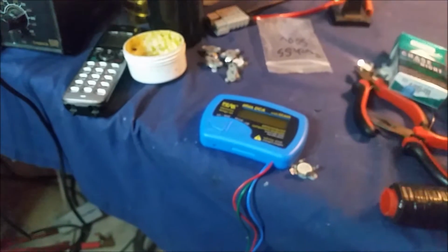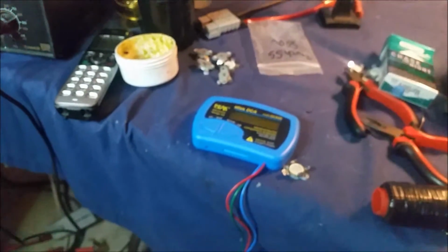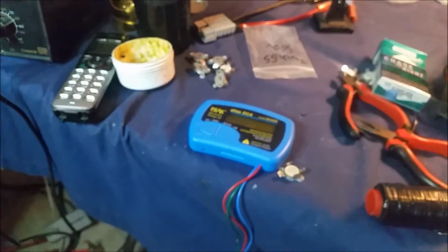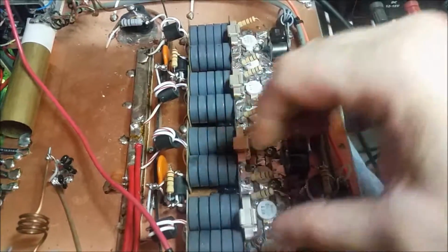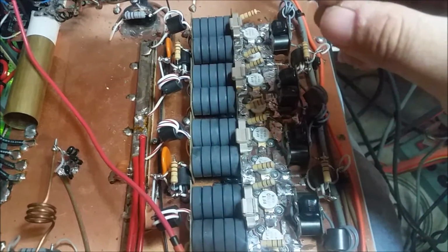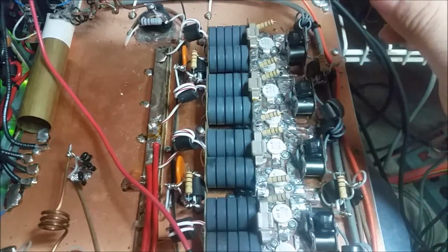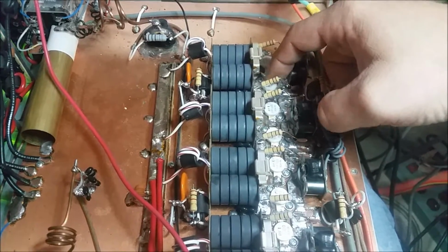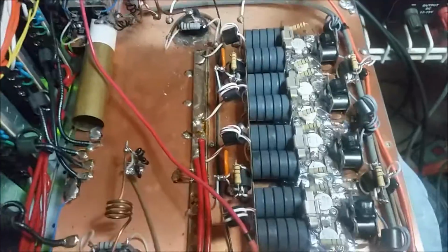Now, if I look at the transistor on a diode meter, the old style of looking at things, it actually shows good. But I dare not try to use one, so pretty much I had to replace all 8 of your transistors, and luckily I had enough. So anyway, once I changed all your transistors, I went ahead and put the 150s on and replaced all your resistors here that was blown, and new 10 ohms and everything. I was only getting power out of these 4 right here. That's when I discovered that one of the 4 transistors I had put in here was actually reading as the series diode network, and it was the transistor that was right here. So I pulled all 4 out, checked them again, and then replaced this one right here. So now it's up to good. It's up to par. It's working good now, man.